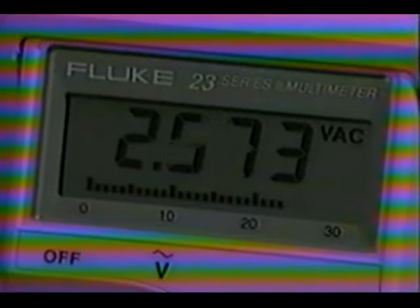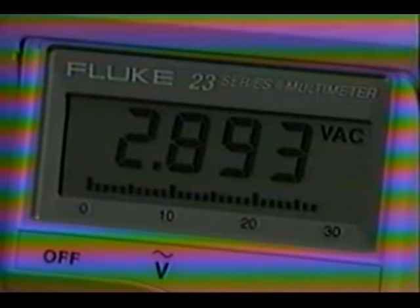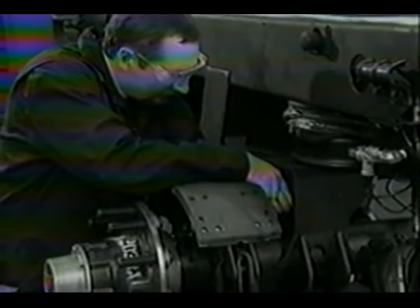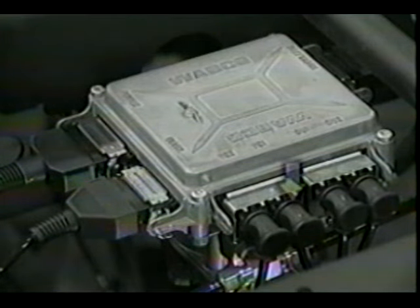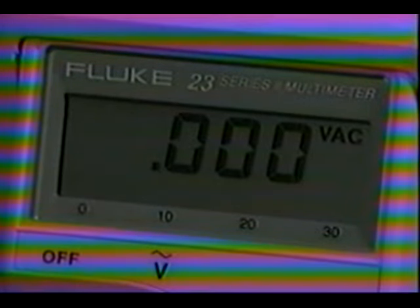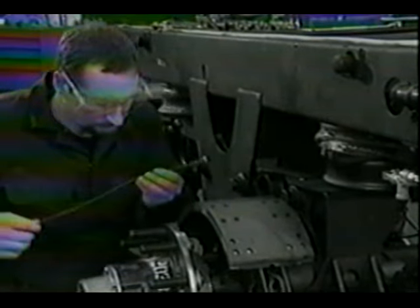Voltage should be consistently above 0.2 volts and should increase as you increase wheel speed. Remember, though, that this was an intermittent problem, so you may have to tap or wiggle the suspect sensor and cable to recreate the condition. The short may also be in the extension cable that runs from the sensor assembly to the ECU, so check this cable too. In our case, the voltage occasionally drops below 0.2 volts as you wiggle and bend the cable assembly near the sensor. This may indicate a short inside the cable.